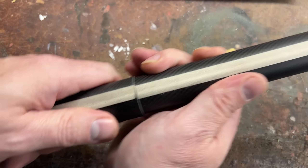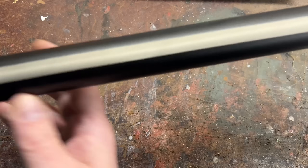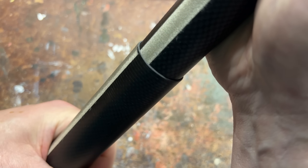There's a reason for this, and it was kind of a weird discovery on my part: yes, you can do the fold-over, but then the friction fit becomes a bit arduous and a bit of a pain. These elements capacitively couple — you've got a piece of tape, a piece of carbon fiber, and another piece of tape, and effectively they make a capacitive couple. When you slide these two pieces apart you're going to have about a one-inch overlap, and you can rotate them, which changes the capacitance of each section.